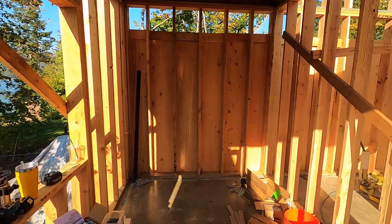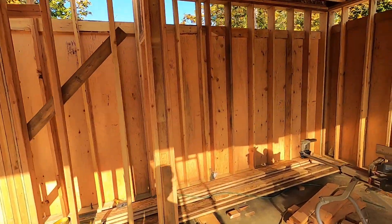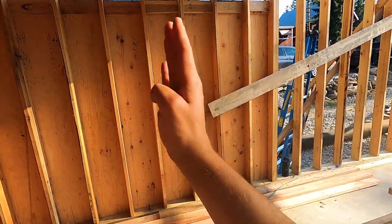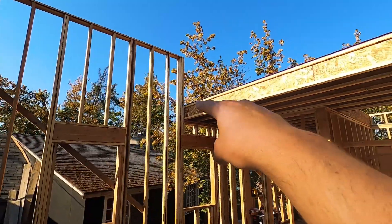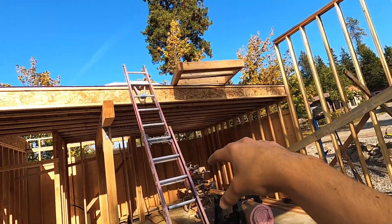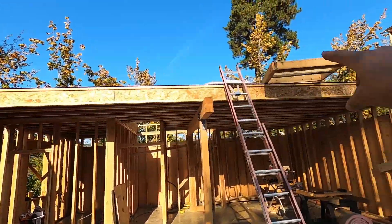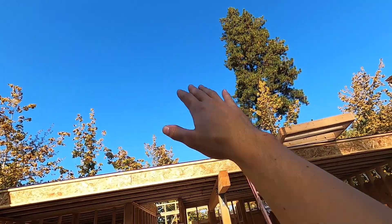Update: we've got that wall sheeting done on the back, which helped with our lateral side-to-side movement — that really stiffened things up a bunch. Now we've got the first 16 feet right underneath the mezzanine sheeted, and that's going to help with the back-and-forth movement. When we finish that framed wall up top it's so heavy that without the sheeting everything would wiggle around — even though it was braced it still wasn't structurally sound enough for us to be moving up there. We got that first round of sheeting on so we can attach the hurricane ties so there won't be any uplift in a windstorm, and then we can lift that final vaulted wall.